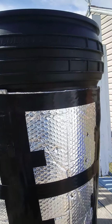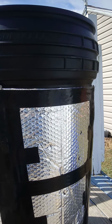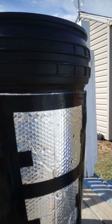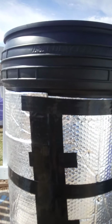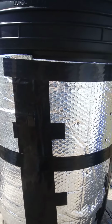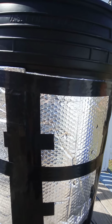And then you put these on. I got some heat shrink. Get some heat shrink there. And then the last thing that you want to do is you're going to want to use some sort of insulation. You can go to the sporting section and get those camping mats. You could take a moving blanket and wrap it around. Again, you're just trying to keep all the heat in, because this thing's not insulated, so all the heat will escape out the side. That's why you need something to insulate it. And then I just used Gorilla Tape to secure it.